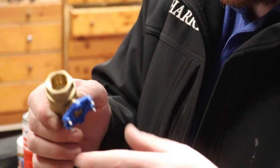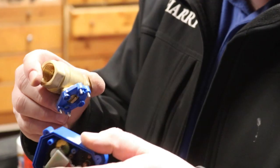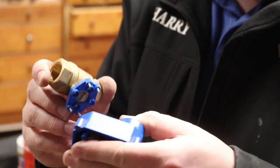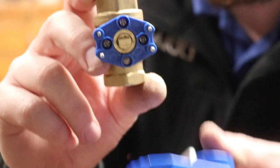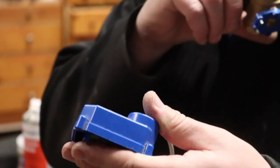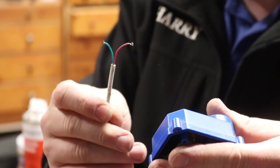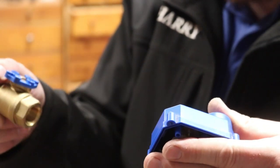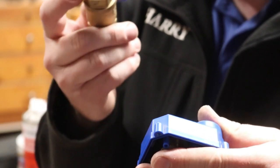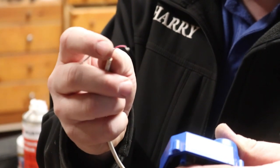What happens with these electronic valves is this attaches to the back of the valve body — it's got a little cam on the back that goes into a corresponding slot on the motorized unit. With the two-wire version, when the polarity is switched the motor goes either forwards or backwards, either opening or closing the valve. With the three-wire ones you have a permanent negative, and the positive feed switches between the other two wires, pushing it backwards and forwards.